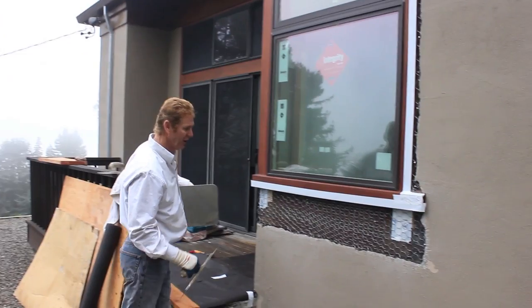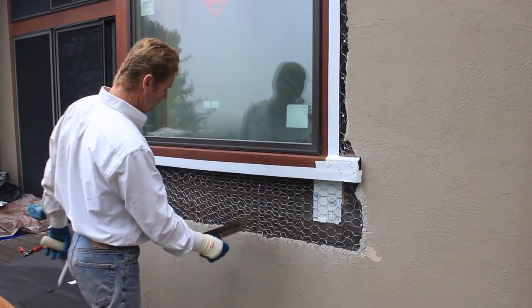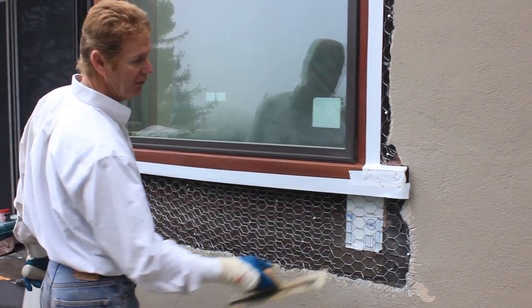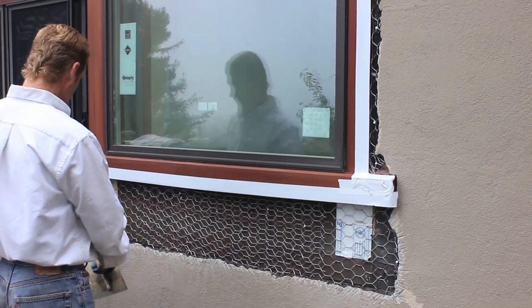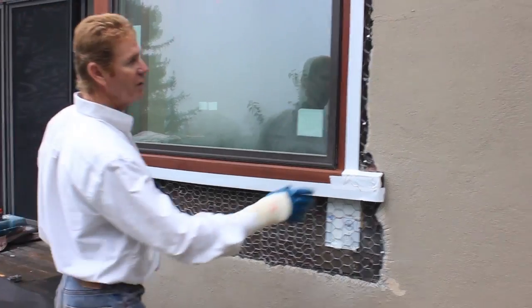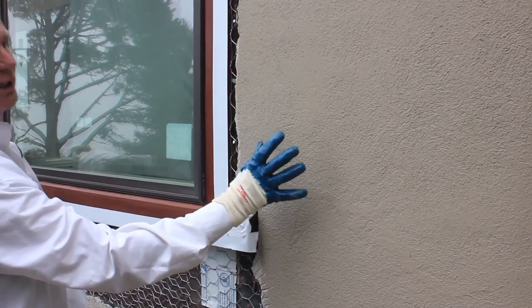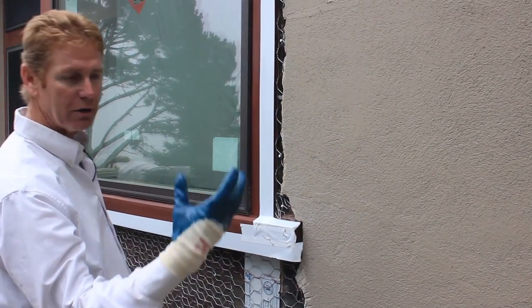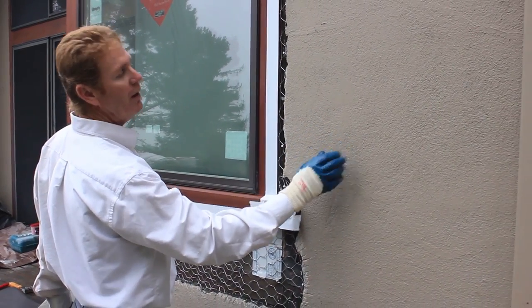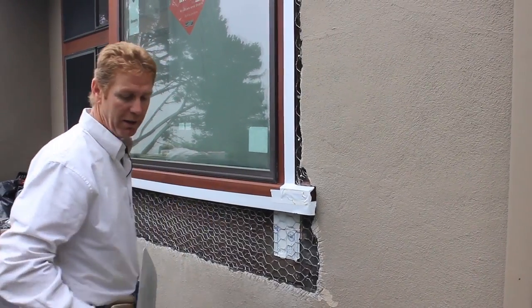Anyway, what we're going to show you today, guys, is this fella, the contractor, he scored all this with a saw blade thinking, well, gee, if I score it, will it stick better? Not necessarily, guys. You don't really need to score it like that. He did a real nice job with the paper and wire. What we're going to show you how to do is match this finish here. This finish was originally a 2030 done by a color coat, a cementitious type finish. And you apply your third coat and then you float it, which gives you that. But it's been painted so many times, I'll show you another way that we could match that.